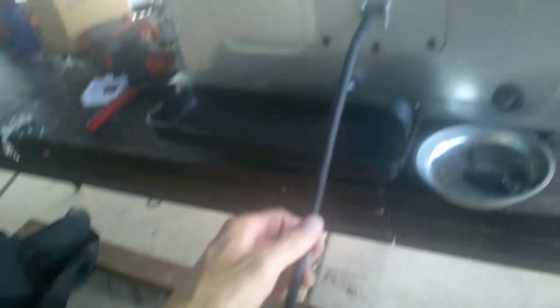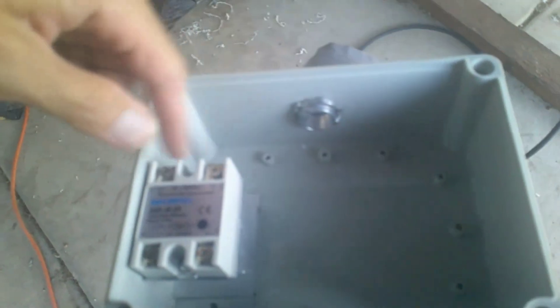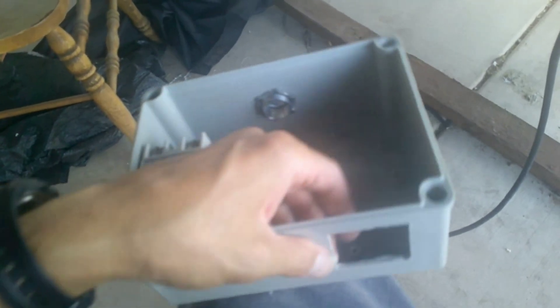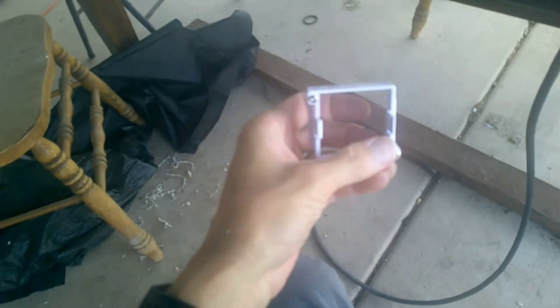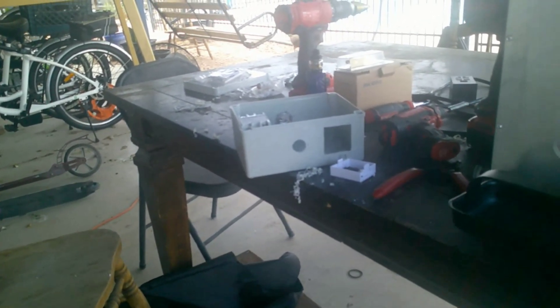Next I'm going to run the element wire and the power wire through this little hole, and they're going to branch off and go their own different ways. I'm going to steal power from that to power the controller. I'm going to wire the controller outside the box and then shove it into the hole when done, because it's much easier since it plugs in from the back. Wire it up outside this square, then shove it in - it comes with a little locking bezel that slides from behind and locks it into the hole. I need to find some smaller gauge wire for the power on/off for the PID controller and some other miscellaneous things.